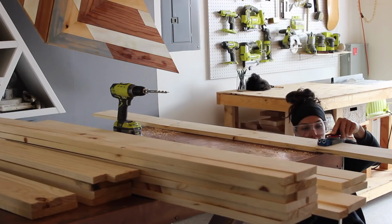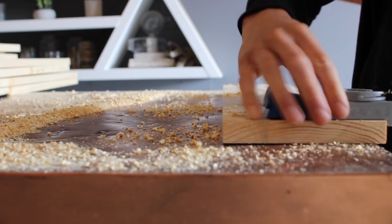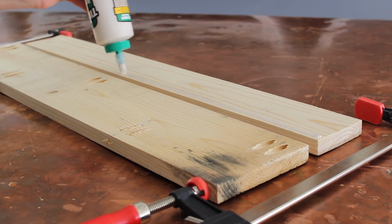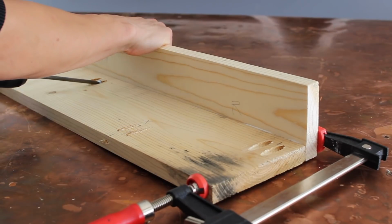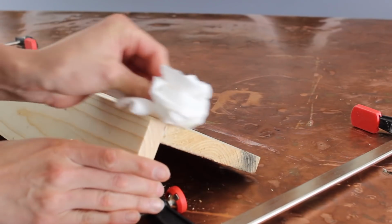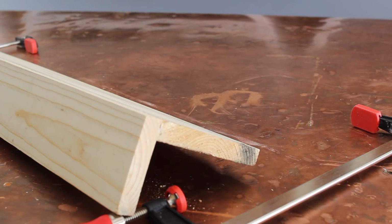So I went ahead and drilled those holes along the long sides where the pieces will be connecting from the front and the back. I linked my in-depth pocket hole screw tutorial up in the cards for you and in the description down below, but you'll start to see as I'm assembling these shelves, some of the drill holes will be facing up and some will be facing down. And the reason that I did that is because I am positioning them on a very tall wall and I want you to be able to not see the holes.